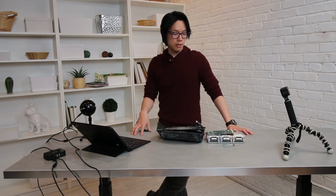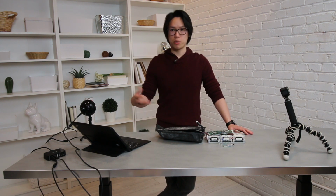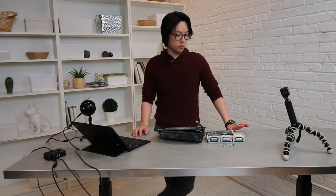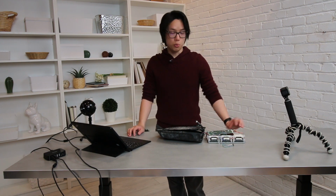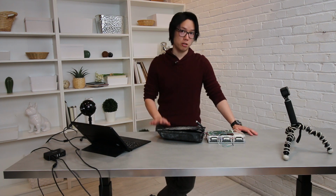Disclaimer: as of today, connecting to UART on the BMS will not give you anything. You will not be able to unbrick it. You will not be able to remove the red light of death. It is only for testing purposes and for curiosity, really. What you will see are debug messages. You will see data like bootloader and firmware version, and potentially some information about the battery, how many charge cycles, how many writes have happened to the flash memory.